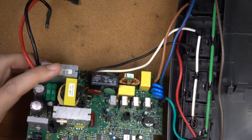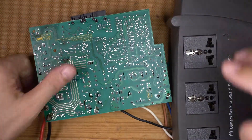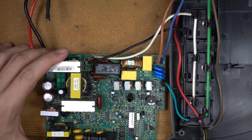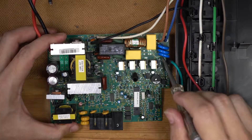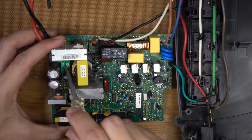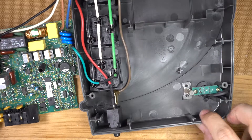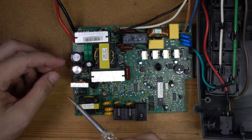There's nothing much under the board. There's a 10 milliohm resistor here — probably there for a current measuring function. There are some MOVs and a couple of car-style automotive fuses rated at 30 amps. There's an LED on board — it goes through a light pipe over here that brings it outside.